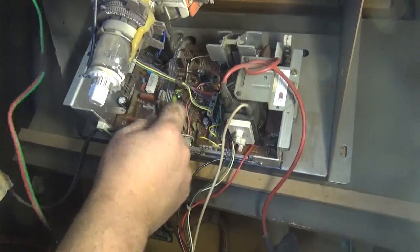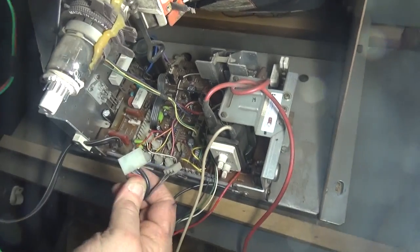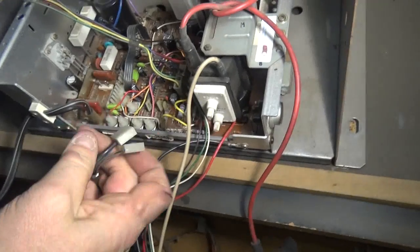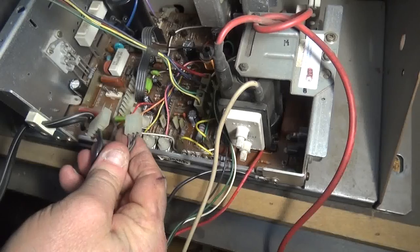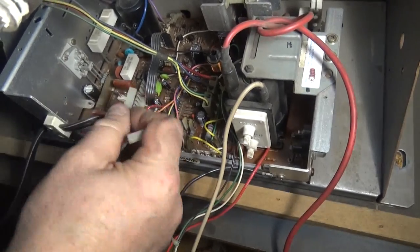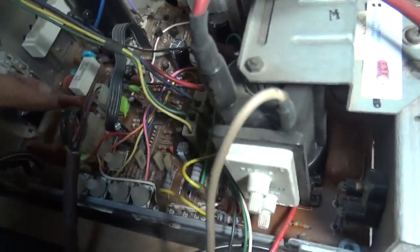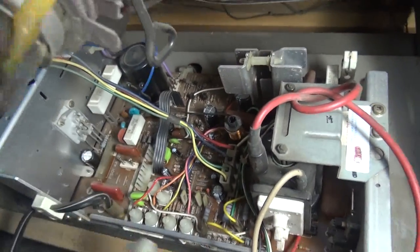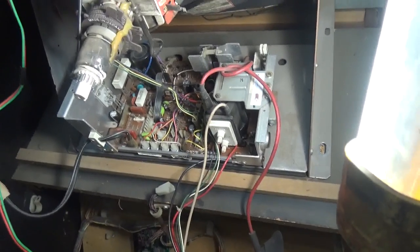This is your data from the Spy Hunter game — carefully unplug it. You can see the red, green, and blue — that's the color and ground. This is the sync connection. When you plug it back on, you could actually plug it in wrong because there are leftover pins. So make sure when you return this plug you're doing it just right. You won't hurt anything, but the picture just won't be right.